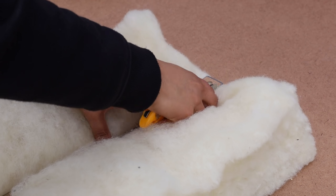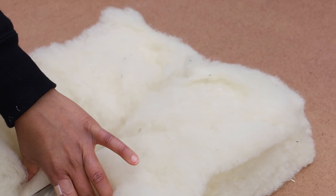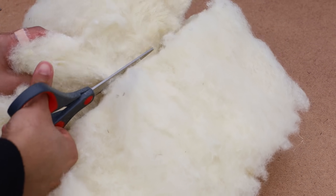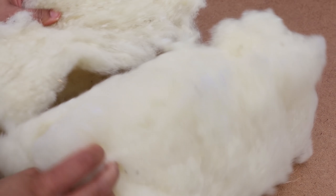Sheep wool fibers are also surprisingly strong. They can't be cut with an exacto or a bread knife — you need to use a pair of sharp scissors or a proper insulation cutter. Noise reduction coefficient or NRC is a rating of how much sound a material absorbs. I couldn't find the NRC rating for hemp wool, but I found a study that claimed it's similar to fiberglass. Havelock sheep wool insulation has an NRC rating of 0.9, which means that it absorbs 90% of sound.